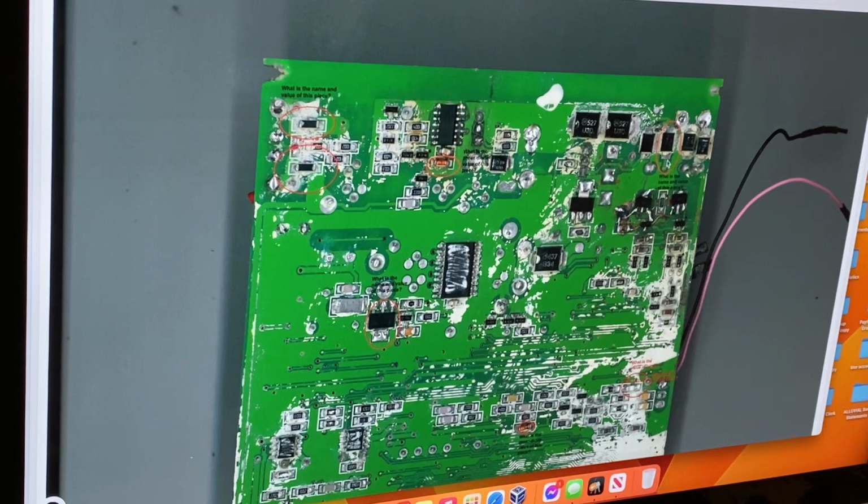This could be something strange like an 84-volt Zener diode, or as some people call them, Xena diodes. Xena, the warrior princess, but spelt with a Z or a Z if you're American. I'll have to check up on that, but yeah, it will operate without it. It'll actually operate probably with all these diodes removed, but just check to make sure they're not short circuit. These two here are connected in series. I do remember that much.